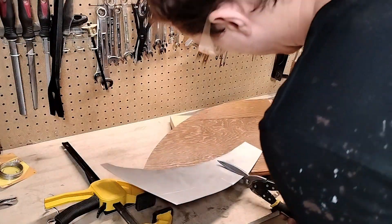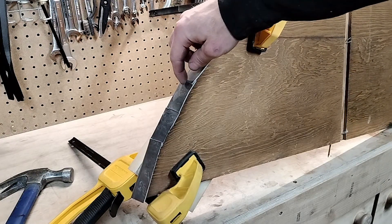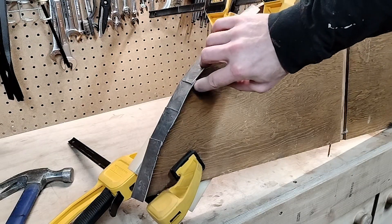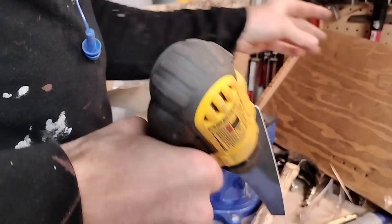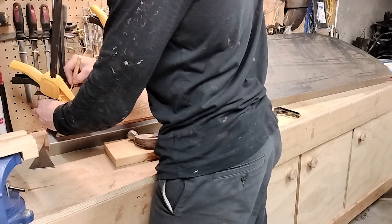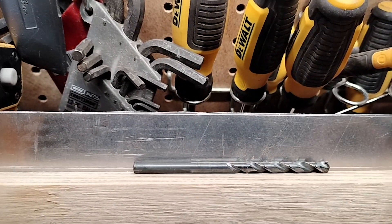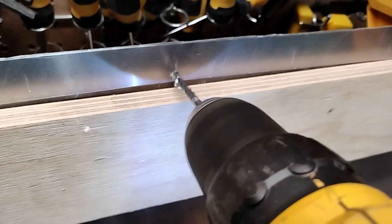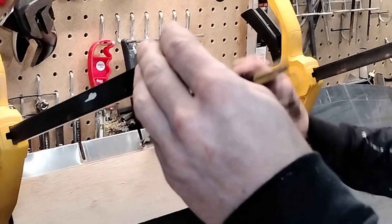That's why I'm practicing with this piece of scrap metal here. It's clear that I need to take a little bit of material off because when it folds over it overlaps and I don't want that. That might be the perfect snip — maybe if I drill a hole to curve it down there, that would make for some nice fold-over spots so it won't overlap. Having learned a lot from practicing on the scrap metal, now I'm using a ruler and a scribe to lay out three and a half inch tabs along the edge. I've been using this drill bit as a spacer to center punch the end of my cutout channels for the tabs. Now I'll take the powered snips and cut those channels. In theory, the gap that the automatic tin snips nibbled should give enough room so they don't overlap when I fold it over.